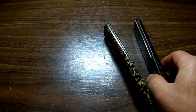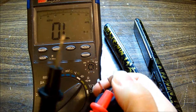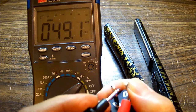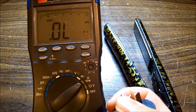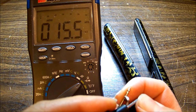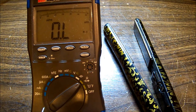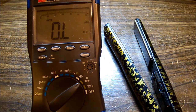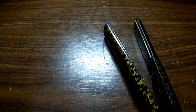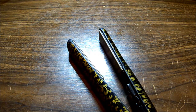The first thing I'm going to do is grab my multimeter and test the mains plug for any resistance to show that it might be connected through, and I've got 560K. Let's do it the other way just for kicks. And if I switch it to on — yeah, so the power switch doesn't really affect that. So obviously wherever the mains goes in it's somewhat live to a point, and the on/off switch is possibly like a soft-on that gets the temp controller going.